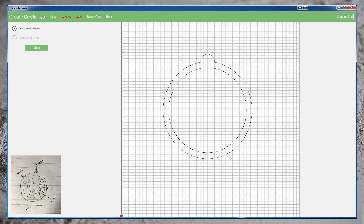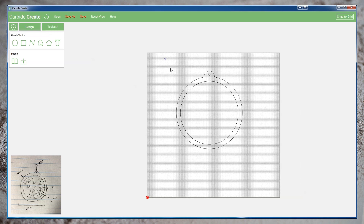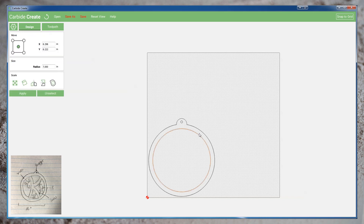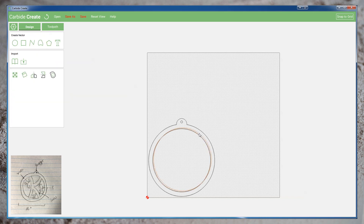A final circle drawn in the center of the extrusion gives us a hole to hang the monogram from. Next we'll need to use some advanced boolean operations in order to create our inner shape. I'm going to start by selecting all my vectors and moving them towards the corner of the workspace, just to give myself some space to work. I'm also going to select the inner profile and use the Control+C shortcut on the keyboard to create a copy of my inner profile, moving it to the side so we can work on it further. We'll use this profile as a guide to help size future elements.